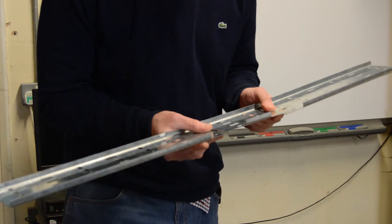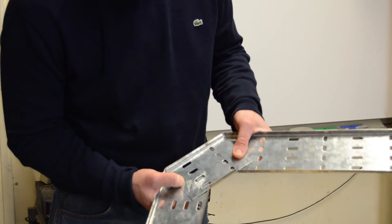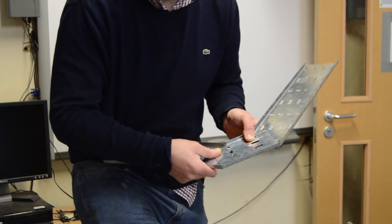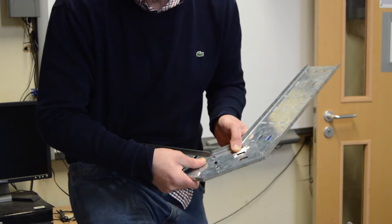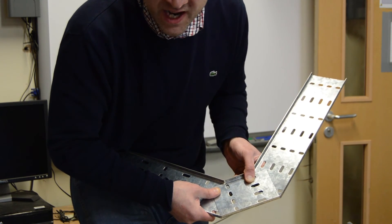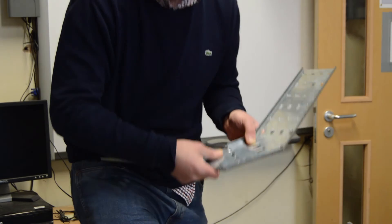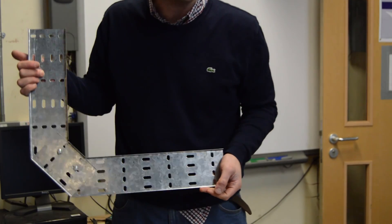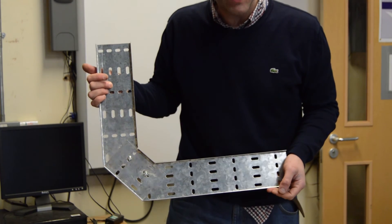The next stage is bringing all our bits together to form our 90 degree bend — so it looks something like that. And we're going to fix this together using M6 roofers. To ensure that our flat 90 is a true 90, we put it against something we know to be 90 degrees and mark where we need to put any holes in it. In my instance, I do need to drill some holes — you can see where I've put my black felt tip, that's where I'll be drilling for my fixings. Once we've fixed it together, it should look something like that. You may feel you need to secure it with more than two roofers, and if you do, that's fine. And I think you'll agree, that's one sick right angle bend.